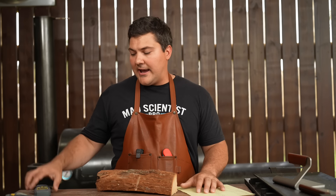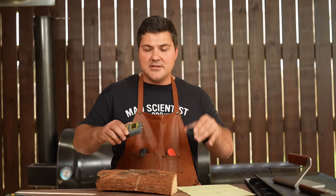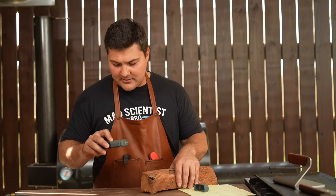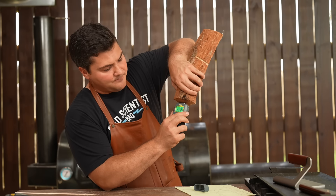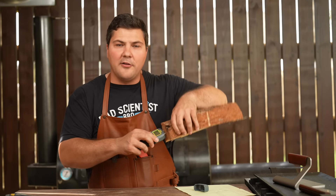One of the issues is moisture, and a lot of you probably have a moisture meter like this. When I talk about green wood, it means a lot of moisture. When I talk about dry or well-seasoned wood, a lot of that moisture has dissipated. The problem with these meters is you can only measure the moisture content on the outside of the wood. What they recommend is probing the end grain. I'll turn it on and we'll see what we get — looks like about 12% moisture.